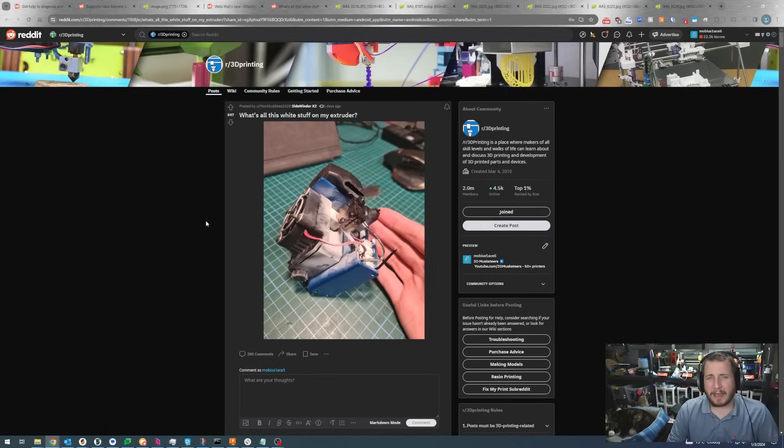I'm actually surprised we don't see anything from UL about the dangers of 3D printing particulates. A basic air filter fixes most of these problems — we have a DIY HEPA filter we've been trying out, and if you guys want to see a video on that, let me know. It doesn't involve any 3D printing, it's stupid cheap to build, and it costs less than $100. If you want to clean the white residue off, a damp paper towel will do it — but it's going to keep coming back. A great way to contain it is to put a silicone sock on that hot end.